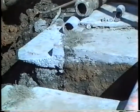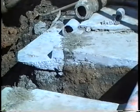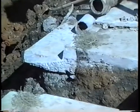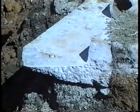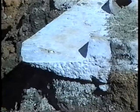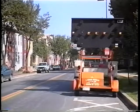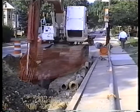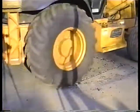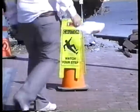Attention must also be paid to any surface encumbrances next to the trench — structures, trees, signs, or whatever else that might get in the way or fall in, such as this curb and gutter section. They should be identified and then moved or supported. All warning systems should be checked for proper placement and functioning: advanced signs, barricades, and other devices around trenches, and backup alarms for heavy equipment. Not only workers and motorists need to be warned, but also pedestrians.